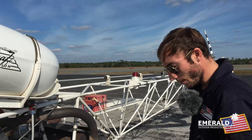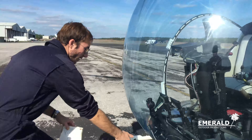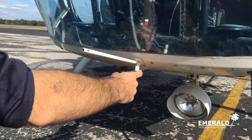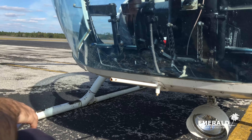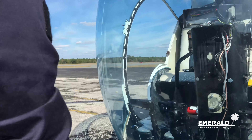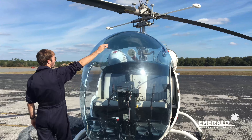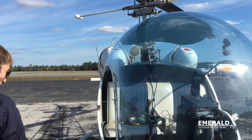Left skid tube — I step to the side and look down to make sure we still have something left on the skid shoe. You can actually see light between each one of the skid shoes when you look down, so we know we have good skid shoes. Those skid shoes are really just a bead of weld on a metal plate — if you shear off all the weld, you just put another bead of weld down.